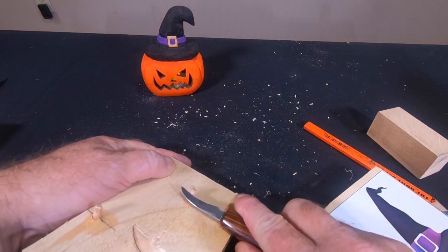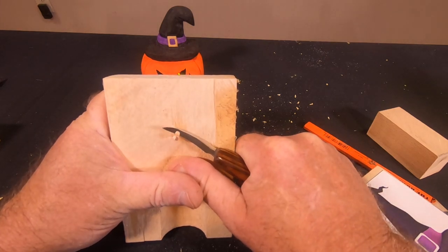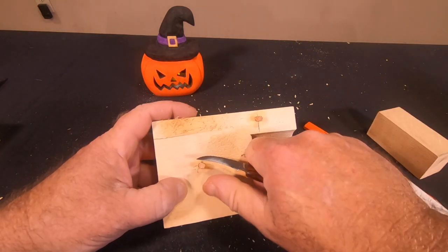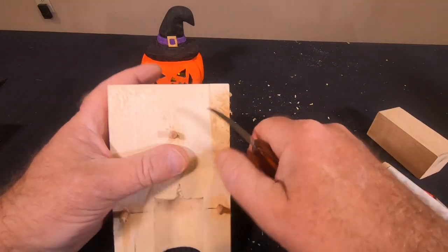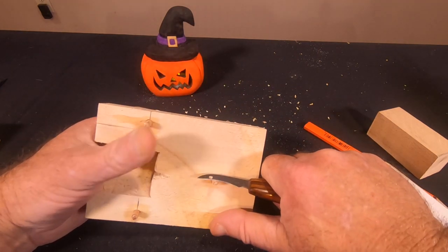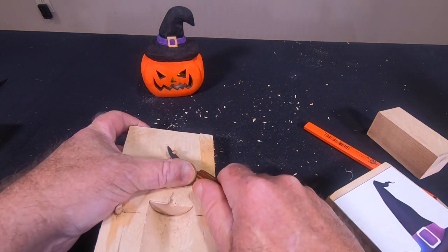No big deal. The other thing you can do is carve the tips a little bit. You can take the tips off a little bit, and that'll help it line up when you go to get your hole lined up as a full piece. Don't glue both sides, just glue the one side so it holds the pegs in there. And if you have to, just take your peg down a little bit.